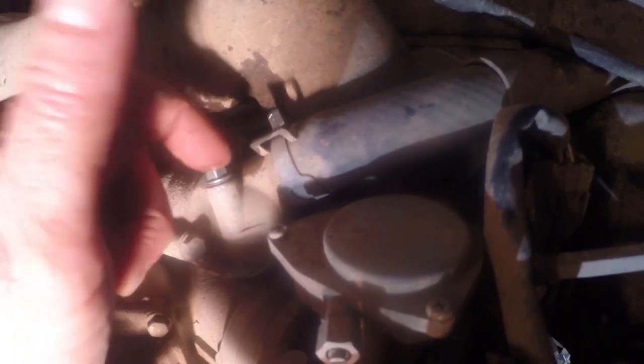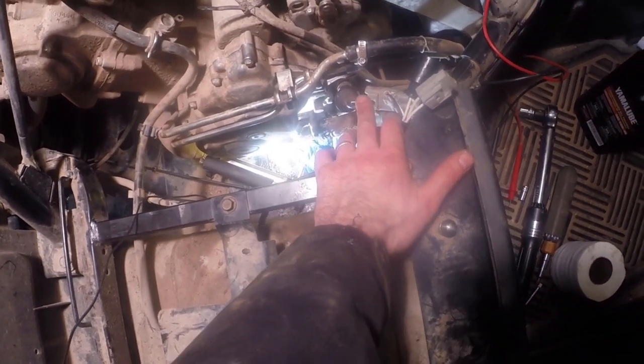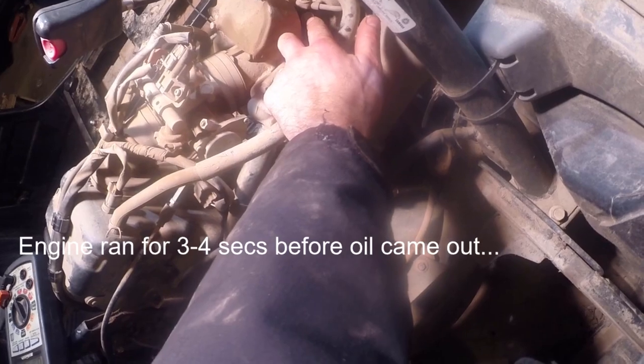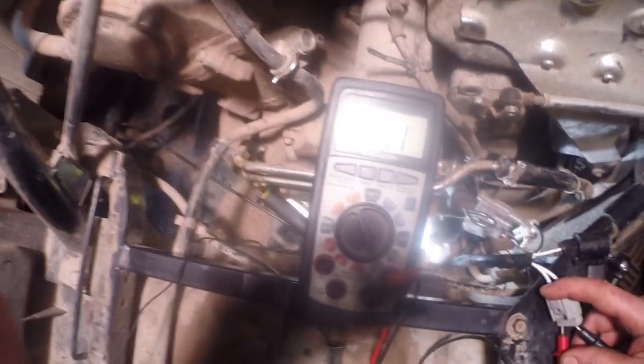We filled it up with oil - two liters took care of it. We'll check it after the machine has run and warmed up. A fascinating thing I've never seen before: they actually want you to bleed the pressurized oil system when you change the oil. To do that, there's a bolt right here that you loosen about two turns - don't take it out - then start the engine. When you see oil squirt out around the threads, stop it and tighten it to 88 inch pounds.